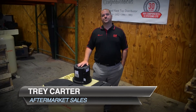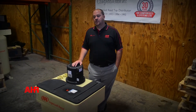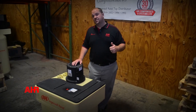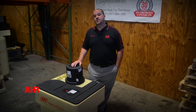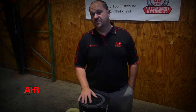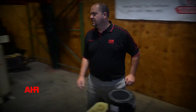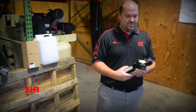Instrument air is basically what you would use in your plant, and you definitely want that air clean. There are ways to do that with inlet filtration on your compressor package. You can go as far as doing high dust filtration on your air compressor as well. In-line filtration is a big thing. A lot of plants think about compressed air but kind of forget about the filters. So we have a couple of filters over here just to show you what you should do.